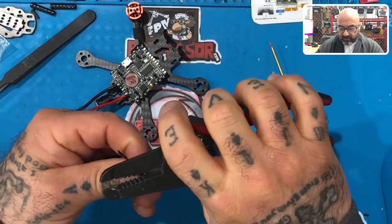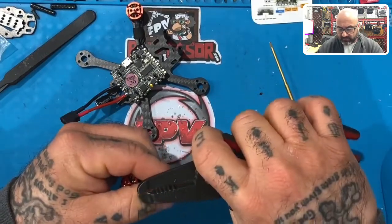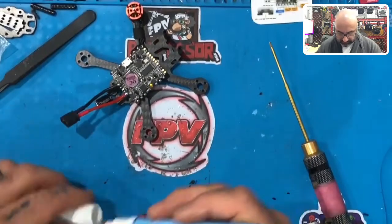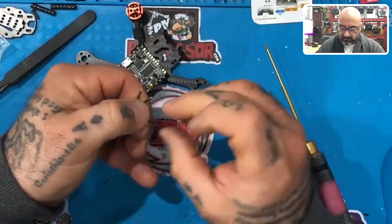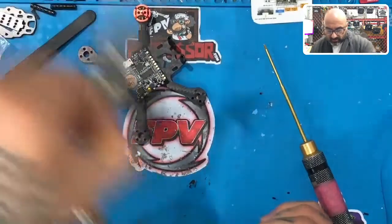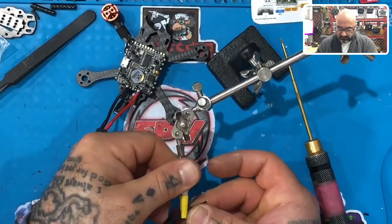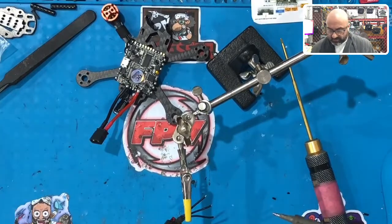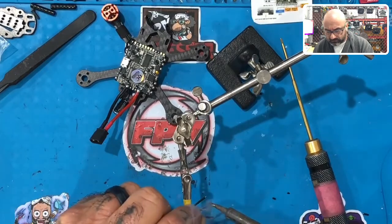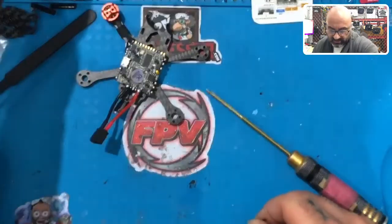And I'll keep the video running, but obviously it's just gonna be repeating the same thing over and over. Okay, so we're gonna tin these, strip them down here, just like that. Put the flux on them. Spin the wires up. Get the helping hands. And tin the motor wire real quickly. Okay. And with that done, put that aside.